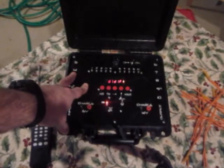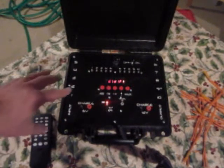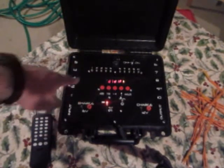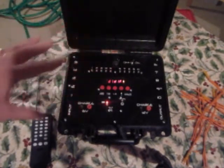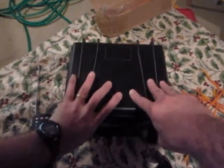Something I want to point out: because a sequencer is out in the field, far away from everyone, you're not going to be able to see these LED lights light up. So what we've done is put a power-saving circuit in here — after about a minute or a minute and a half of non-use, it's going to shut off the screen and basically disconnect the LEDs from the system. It still fires off; there's just no need to have all those lights running when the system is down and locked, because you're not going to be able to see it.